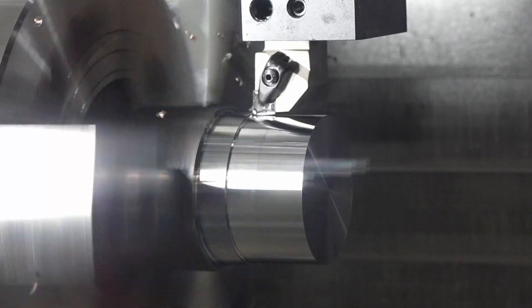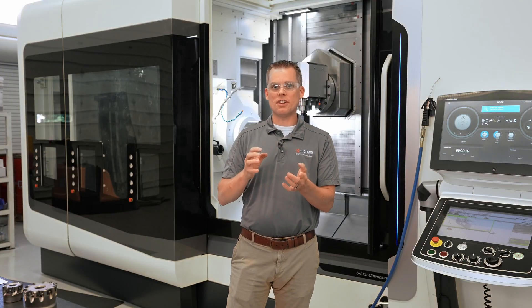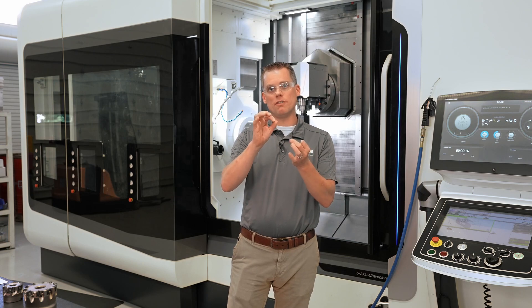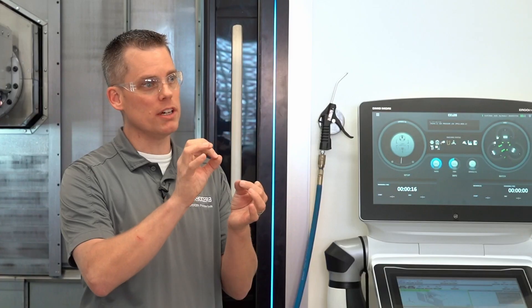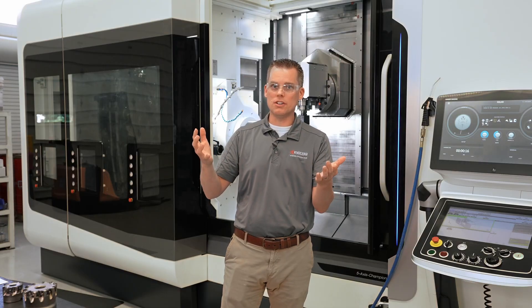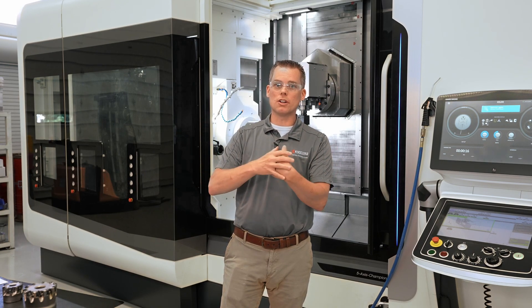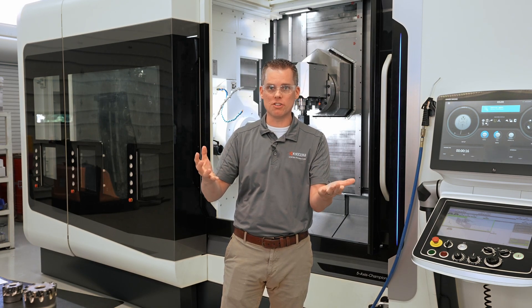In some cases, because a wiper allows you to feed an insert through the workpiece faster, it spends less time in contact with material, which in theory can increase your tool life, and it has in some cases. But at the same time, because of the natural amount of increased contact that each wiper insert has with the material and the extra heat generated from that increased contact — and we all know that heat is the enemy of cutting tools — it can also reduce cutting tool life in your operation as well.